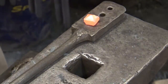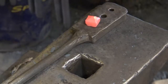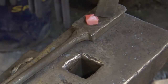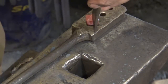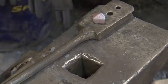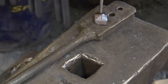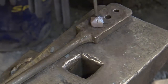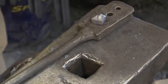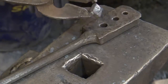I'm going to go back into the heading plate. I'm just going to take a hot chisel and just nick the flats on the pyramid head just a little bit, just for a decorative line. This is something I first saw on some bolts somebody sent me to make copies of. They were for a church door — they held the hardware on the church door and they had lost some when they were rebuilding the door, so they needed somebody to make some new ones. So there's a little decorative element on our bolt.